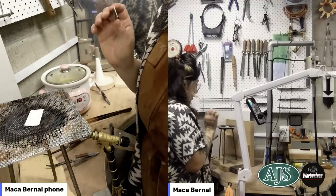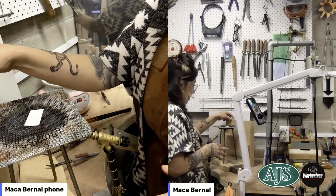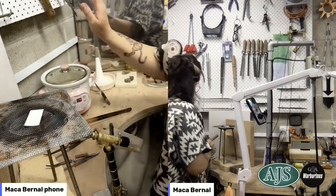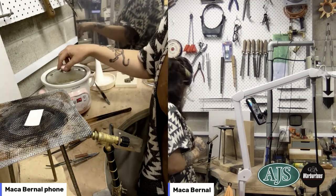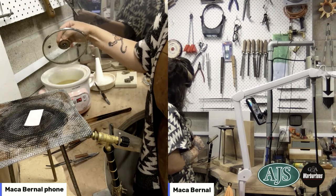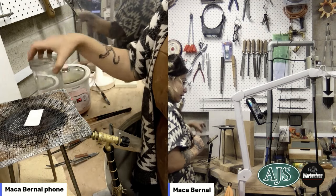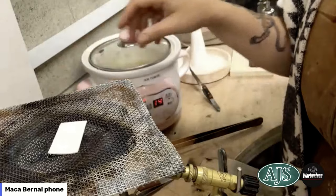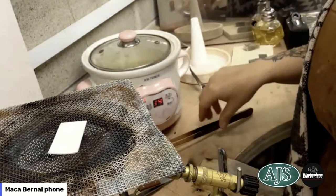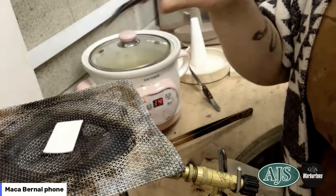The way we're going to make this metal change and sing for us is if we treat it very slowly and very gently. I've got my pickle pot with a very strong concentration today — it's very hot and strong and ready to go. I've also got my quenching water to neutralize the pickle, copper tongs for the pickle only, and steel tongs for holding the hot metal.